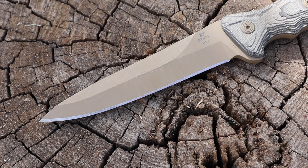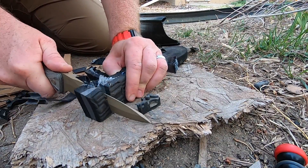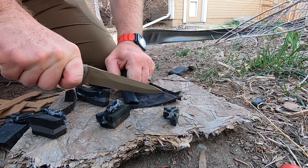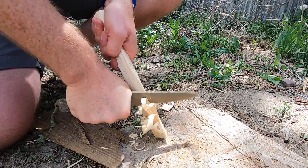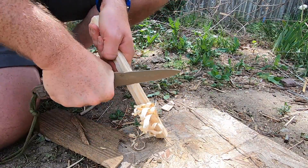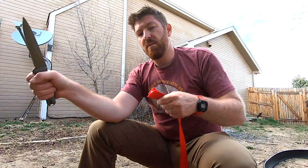What you'll find with knives designed basically as a sharpened pry bar or piercing tool is that the relief edges aren't always great — but they've done a great job with the relief edge here. It is a saber grind that goes up pretty short, so think of most field knives and tactical combat knives. This is not a bushcraft knife; it's not a full flat grind, not great for food prep, and wouldn't be my first choice for a day of woodcraft — I'd definitely grab a Mora for that. But as a general utility tool, the grinding is great. I could do feather sticks very nicely, notching isn't too difficult, and it cuts through all sorts of man-made material — paracord as a jump knife, seat belt if you flipped a Humvee — very easy because of the edge geometry.